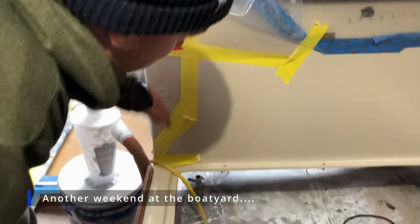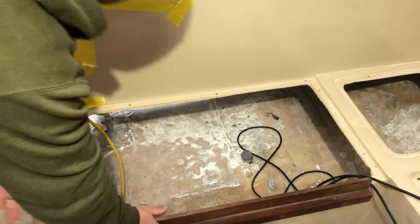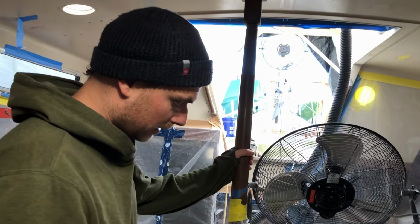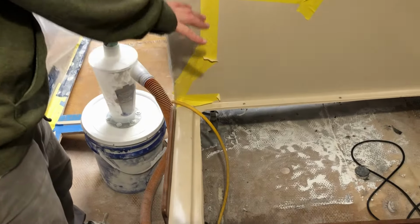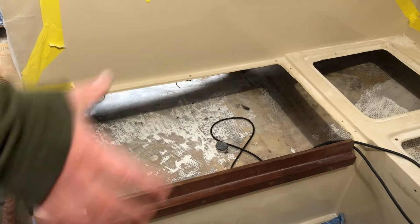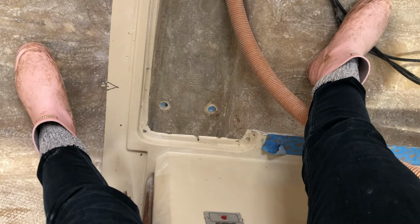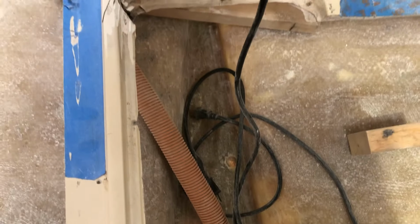We're gonna put a bulkhead into this whole back of the kitchen, and it's gonna go down, it's gonna run across the hall, and it's gonna tie in with the roof and the posts here. So that way we take a lot of load off this back end. And then have the new stringers. We've laid up new fiberglass in the bilge, inside and outside. Yep. Oh, it looks so good.